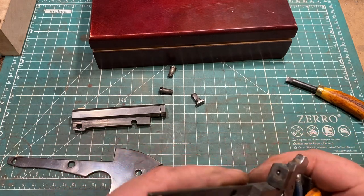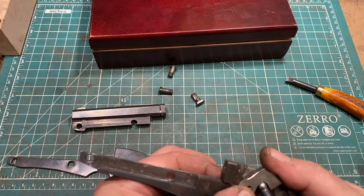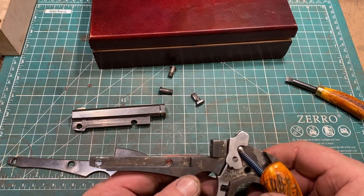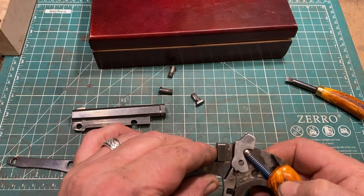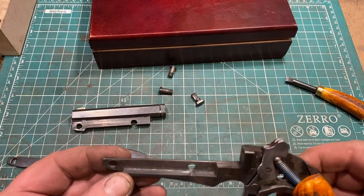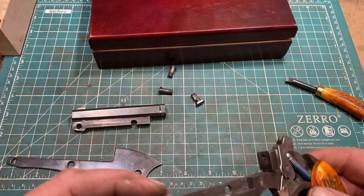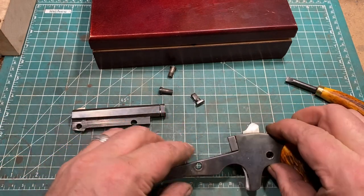Your safety notch — can't drive forward. Full cock, which is deliberately a bit long in the trigger pull, just for safety, because there's no other safeties on the gun. Basically the gun has three — four moving parts, if you count the spring plunger and the firing pin as separate moving parts. Very simple. These bits are soldered together, and the rest is just quarter-inch 5160 spring steel. Very simple, very easy to disassemble, very easy to put back together.